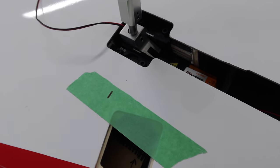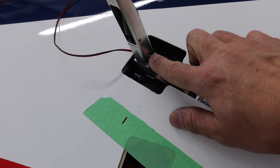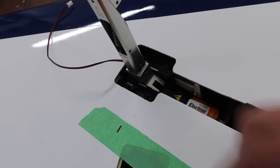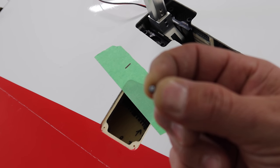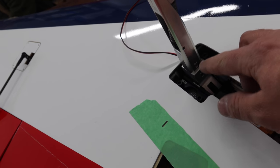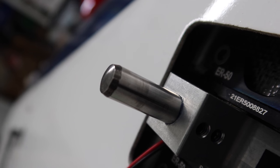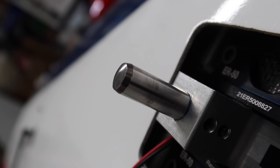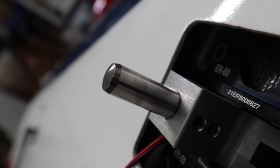Now we put it back in the gear and do the gear side of those bolts and pin, which is far more critical. You can see what the bolts look like once they've got the paint marker on them — threaded in and taken back out. We pull the leg off — it was such an accurate fit we needed to heat up the leg to get it off. You can still see our marks there. Now we take the Dremel and sand little flat spots on there, then get the leg reinstalled.